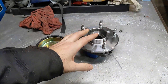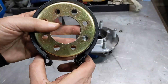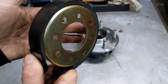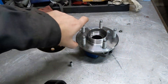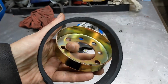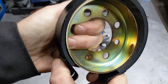If you've ever worked with an engine on a stand before, you know they're never balanced — they want to flip over or turn to the side where the heavy side is down, so we need to be able to prevent that. I've got a brake from a go-kart left over from a project where I blew up the small engine. This drum will go on the backside, the brake band goes on here, and then there'll be a screw that lets you tighten it down so it can rotate, and when you tighten it, it doesn't rotate.